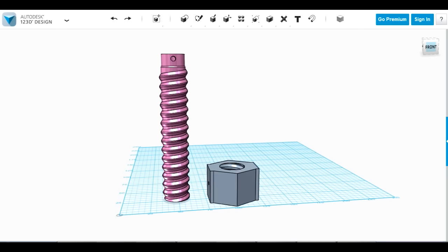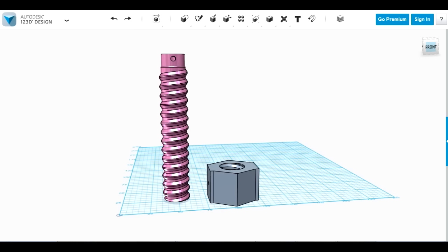When the screw turns, the nut goes up and down, and that's going to actuate a joint — like an elbow. This can't be back-driven very easily because it's like trying to force a nut down a bolt — it doesn't really work unless you turn them. This is really good for the demo to show that we're not just pushing the motor backwards — we're actually going to use sensing to make it drive backwards when a force is applied. We'll get those printed and see how well it works.